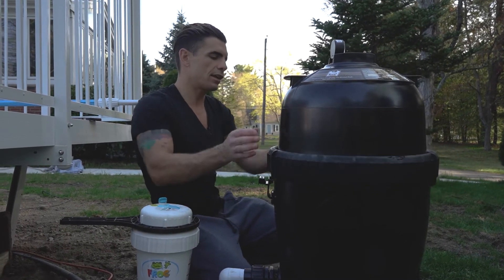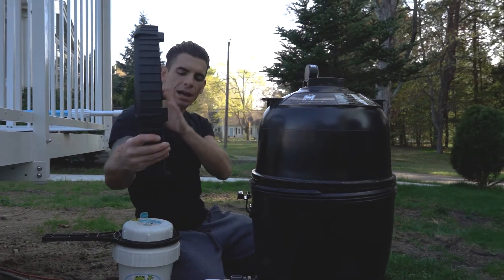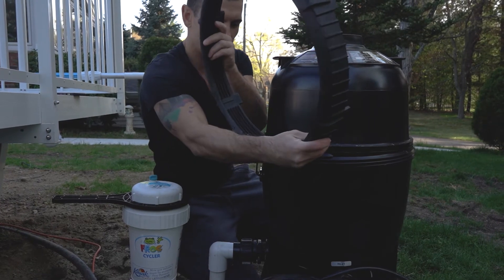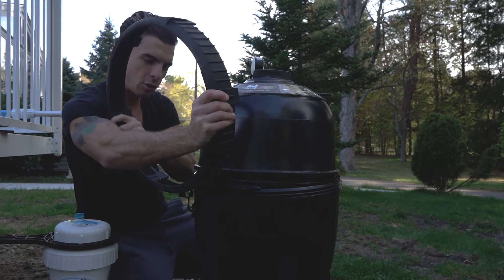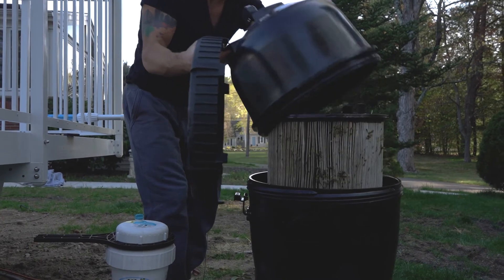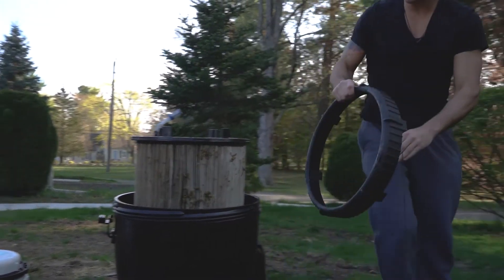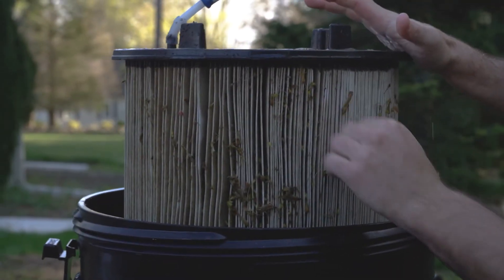Once you've pushed it, the ring is loose. Unscrew the whole thing and take the top half off. The key to getting the top half of the filter off is one of these pegs fits directly into one of these holes — it doesn't matter which one. Put it in, twist it to get it open. Now we have the cartridge. If you look very closely at this cartridge, it's actually full of seeds, grass, pine needles, and all sorts of different stuff that's going to prevent water flow at some point.